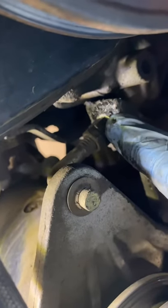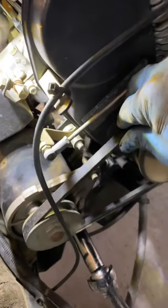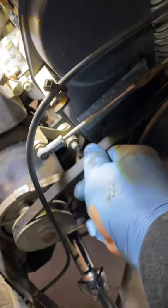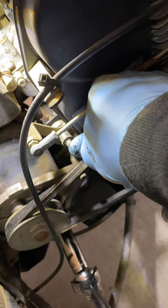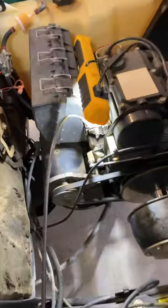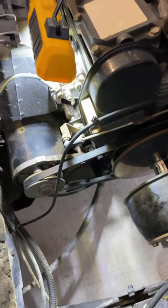I've tightened the bottom tensioning nut and then tightened the top nut to lock it so it doesn't move. I like to check that the belt has about a quarter turn when you twist it, and about a half-inch of movement when you push it up and down. You don't want to over-tighten it so there's no play. Once you've got that tension right, put your wrench on the other side — you may need a partner or a ratchet wrench — and tighten it down. That concludes the generator belt replacement. I'll do a separate video on the drive belt next.